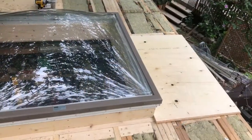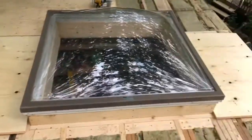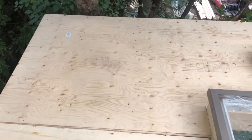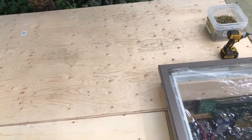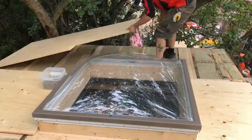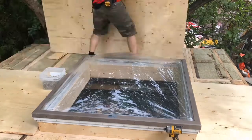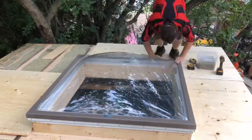Because I'm using tongue-and-groove plywood for the roof to create more structure, I made a big mistake - I installed it the wrong way. So I'm going to flip it over, put it over there, see where it lines up, and come back this way. You've got the smooth side and the rough side - you can hear the difference. To every problem there are multiple solutions. I just took it off after I'd already screwed it down, and we're going to flip it over to the other side where I'll do some additional cutting. Very easy to fix - one of those 'oops, no problem, we got this' situations.